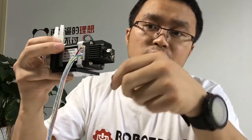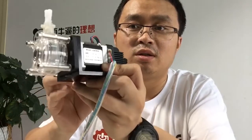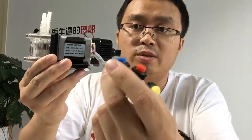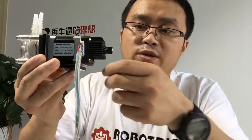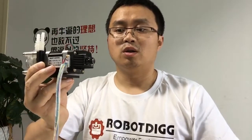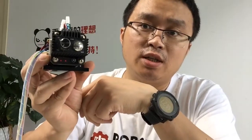Now its value is Y1. As mentioned, we turn the potentiometer to give the pump a speed. And also we can trigger the button for a higher speed. Once the learning is finished and the volume is just as we want, we turn the potentiometer to 0 again and press the button. We will read Y1 and the learning has been done.